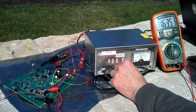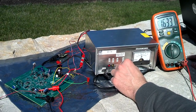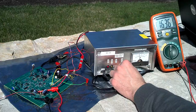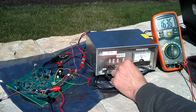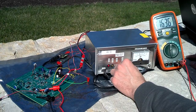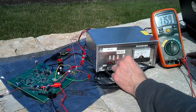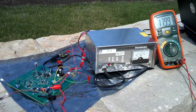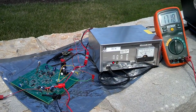No matter what current I pull, it's 16.36, 16.35 — just about. I'm varying it at 500 milliamps at a time and it's pretty solid. If I drop back down — the sun's dropping too — I dropped the load back down, we went to open circuit. Now the sun dropped as well. So that's our max power point tracking.